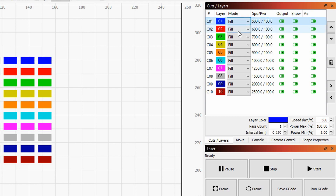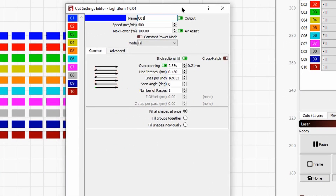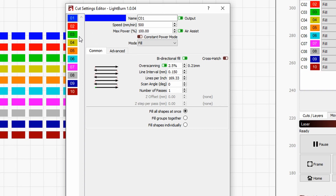For each layer you will want to increment your settings. For all of them you will need to set up 100% power — I will explain in a while why we do that. So 100% is going to be our maximum power and 5% is going to be our minimum power for all of them, 1 through 10. Then the other thing you want to set up is the speed of the axis. As you can see, I've been incrementing by 100 for the first 6, and then 250 and 500 until the end. A better way to work with layers is to just double click, and then with the down arrow you can go through all of your layers.